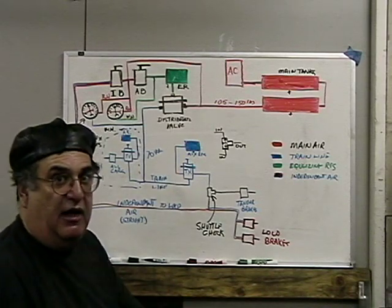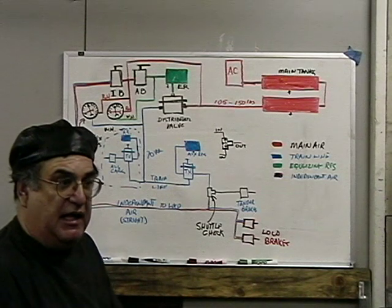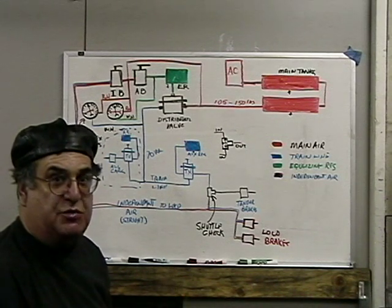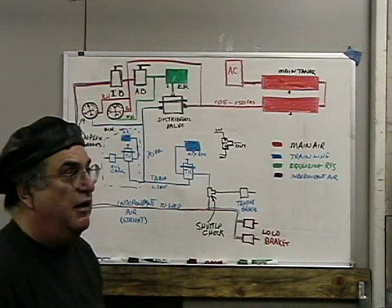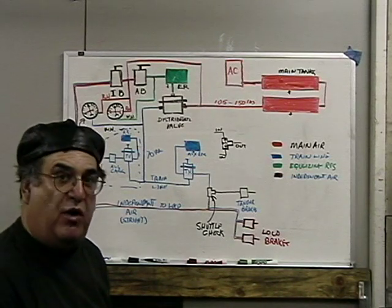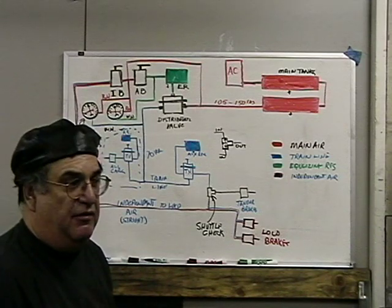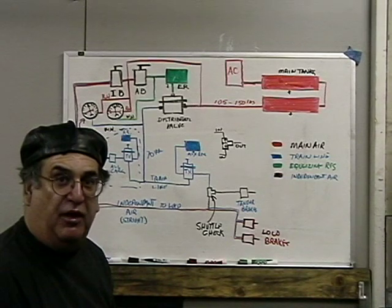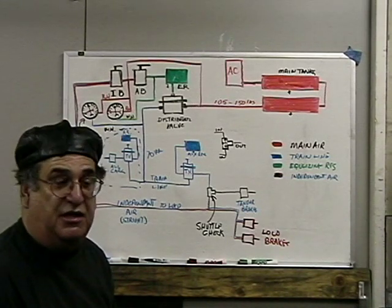I don't have to look at it. I have a detent on my lever. As I come back with it, I hit that detent, I hold it there, that's 5 pounds, and the brakes just come on, and that's what's called the service stop. They just come on gradually, and it's just like driving a car. You don't come up to a stop and jam your brakes on, you start to brake gradually. It works the same way. You put it on there, it comes to a beautiful stop. Now anybody that's ridden on my trains can say, wow, those brakes really work good. And they do. They work great, and I'm a major advocate of using these brakes.